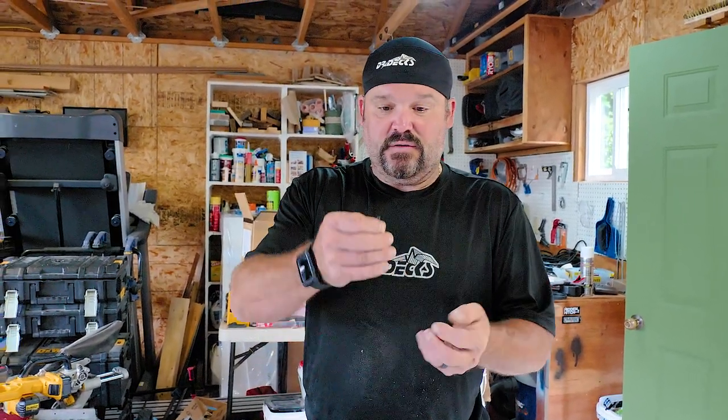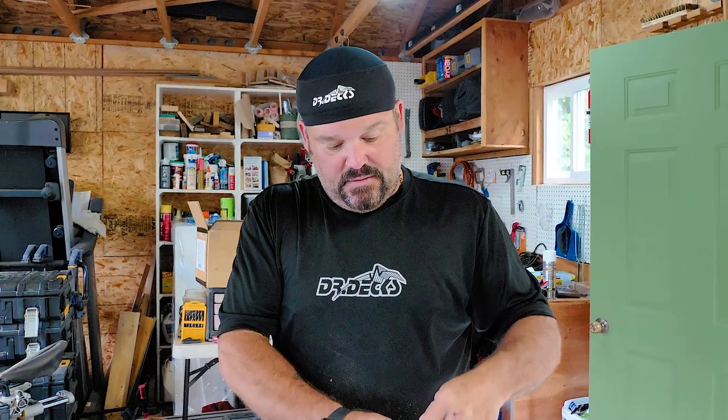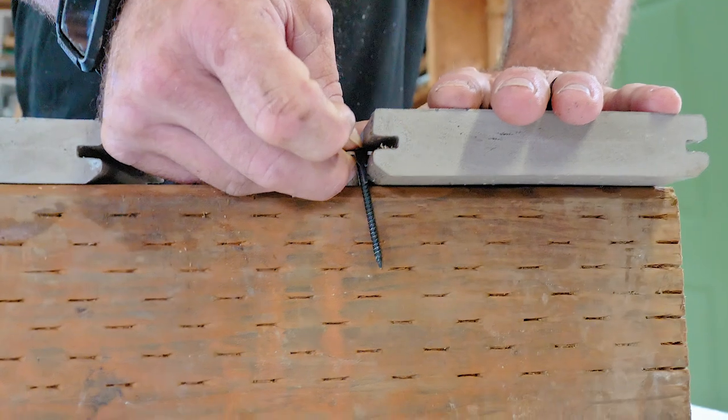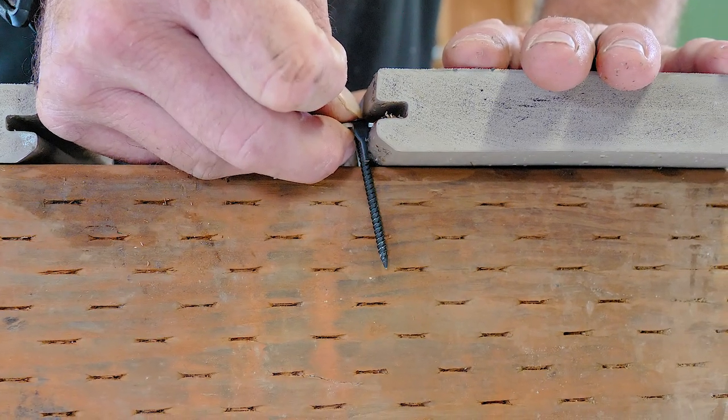Other people say there are faster systems out there, and there may be one or two, but with three guys running these guns it's pretty fast — we're not losing much speed. We really like it and will continue to use it. Another reason I like it is the scrails are two inches long, going in about an inch and three-quarters into the wood — that's good penetration for the pressure-treated hemlock we use here in the Pacific Northwest. Thanks for watching our video on the Fasten Master Fusion Lock gun. If you liked it, click that subscribe button and hit that bell icon for fresh content. Have a great day!